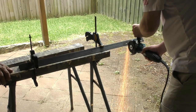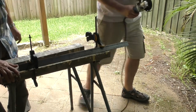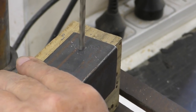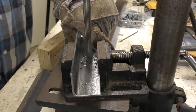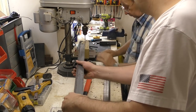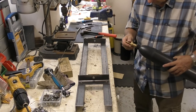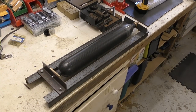We need a way to keep the pressure chamber on the nozzle seat as the booster segments themselves don't have individual retaining mechanisms — they'll be held down by the central staging mechanism. We're making the frame from some 40mm steel angle. At full pressure there will be about 200kg or 2000N of force trying to push the nozzle seat out. Here's the finished stand.